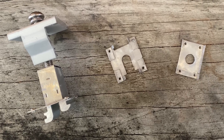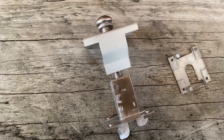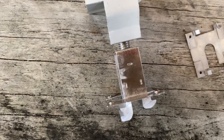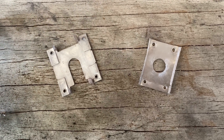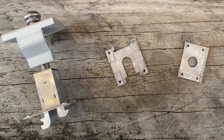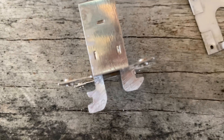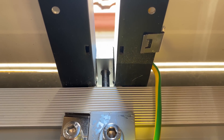These stainless steel surface penetrating washers are used in between the panel and the rail. There are a couple of different styles — just get the one that suits your manufacturer's rail and panel. These have a built-in washer, and this style is just a washer you put in wherever you need it. Each bolt to the panel has got to have one of these washers to create a good earth bond between the panel and the rail. These little stainless steel teeth bite into the aluminium once they're torqued down. There's one of the earthing washers up in there.